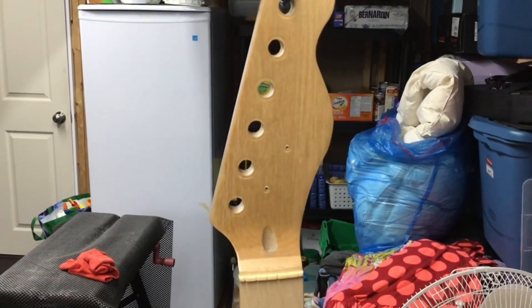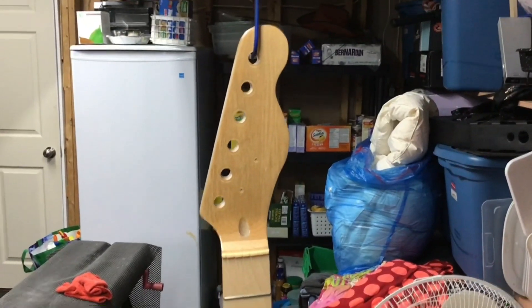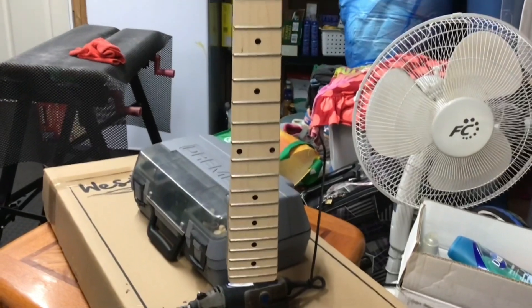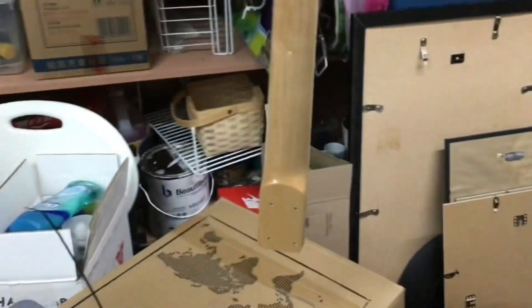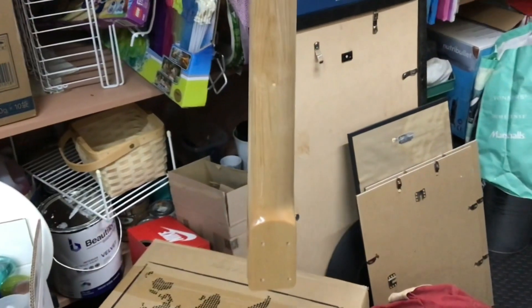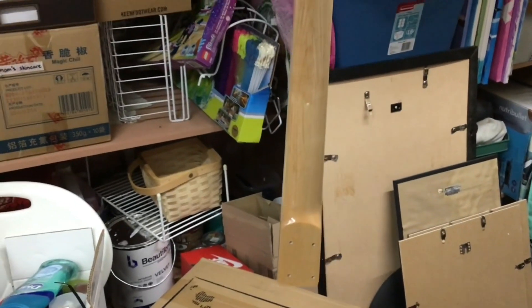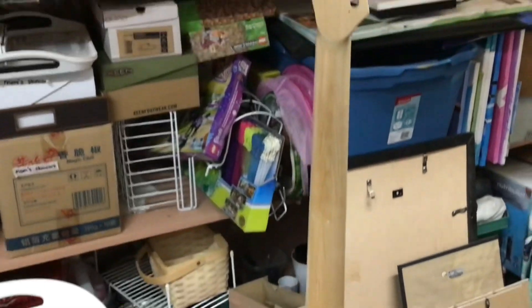It's a hard call. My first video was saying how the guitar was really rough but it's not bad. This neck will be nice once it's done. Now I'm going to take a thousand grit sandpaper, go over everything, make it nice and smooth, and then put some lemon oil on it — just an oil treatment — and this will be silky smooth. I still haven't fixed those off-centered holes at the neck heel. That's the next thing — I'm going to drill those out, plug them, let them dry properly, and then re-drill them once I fill the ones in the body and re-drill those as well.